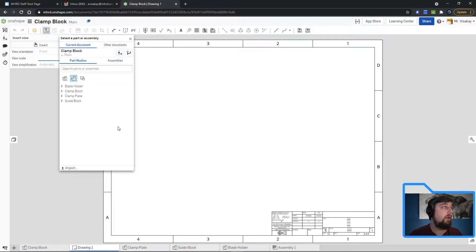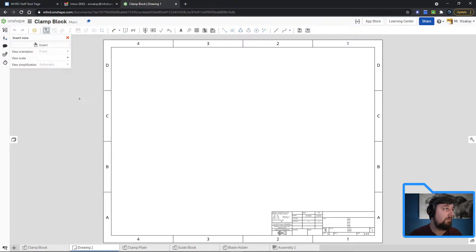Loading... All right. This pops up. If you did not draw all four of your parts, they won't show up here and you'll have to go into other documents to find them. Since I drew four, all four are here. Go to the first one — clamp block. We're placing our front view. I want to fit all four parts on the sheet, so one-to-one scale is a little big. I'm going to change it to one-to-two, so half scale.